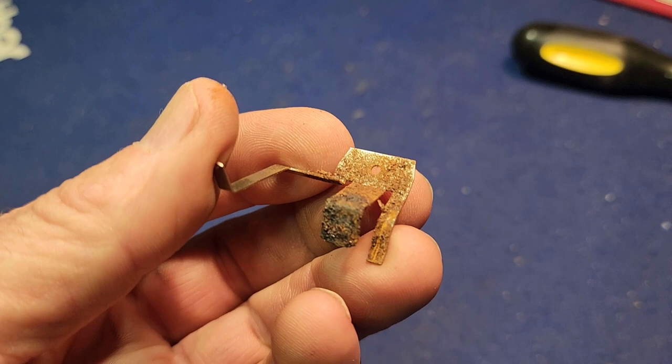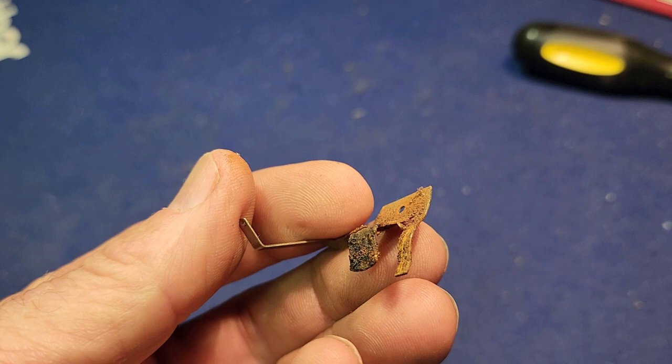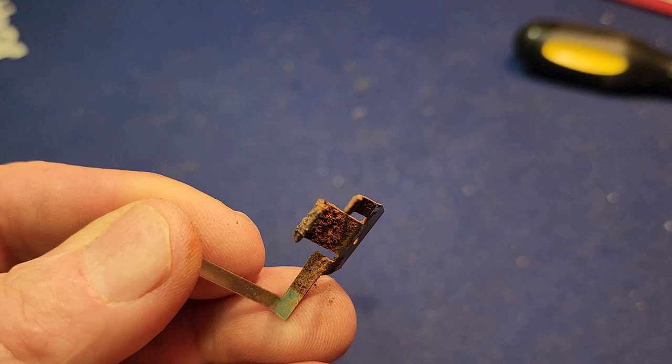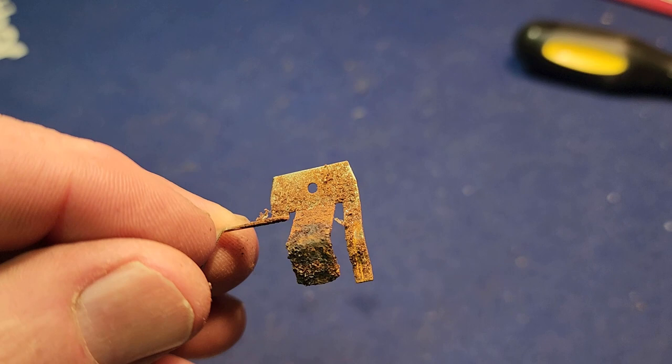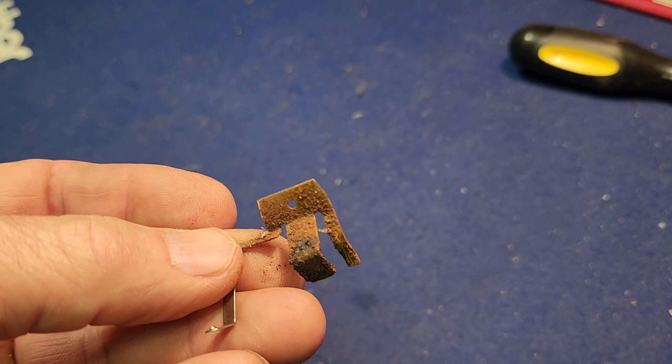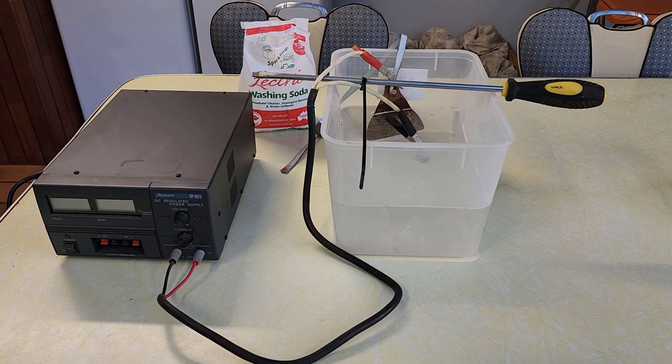Having a closer look at the terminal, you can see it's quite rusted. We can tell from that rust that this is a nickel-plated steel terminal. Some are brass or even copper, in which case you'd get a greenish corrosion or verdigris, but this is definitely a steel one. We should be able to clean that up quite well in the electrolysis, and the metal is still thick enough to hold its integrity. Once we clean it up, we'll try nickel plating and that should come up really good.